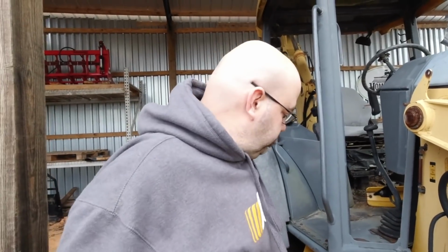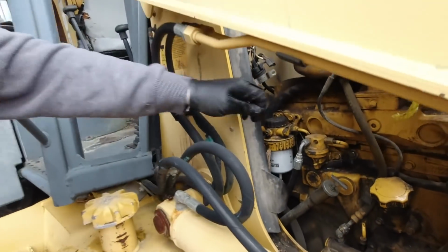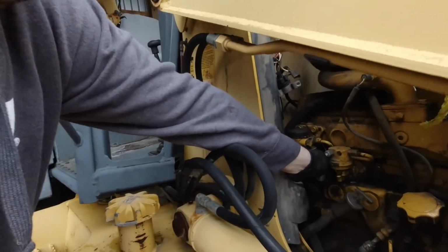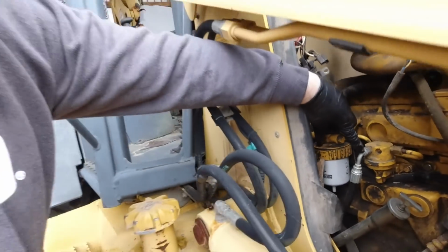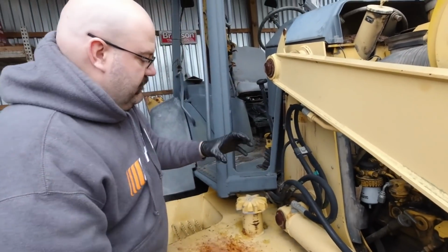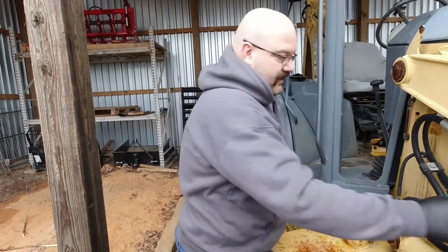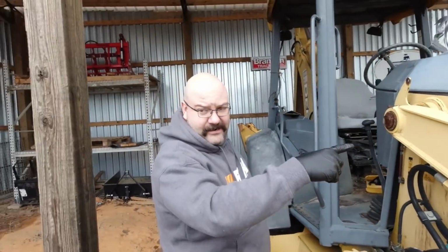All right. Well, let's do that then. Is that nut on there? Is it tight? Yeah, the nut's tight. So that's what I was going to do. I was going to grab a wrench, but I think it might be because these seem to be plumbing style fittings, where they're compression fittings. Yeah. So I think maybe the rubber in that compression fitting might be worn out. Mm-hmm. And again, like you said, Sonny, it's just sucking air here. It's maybe sucking air over there.